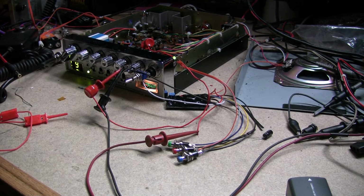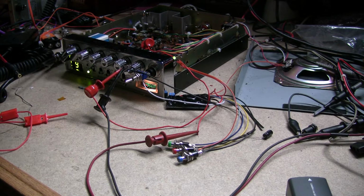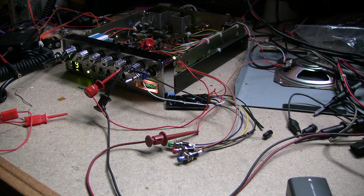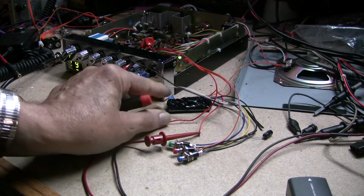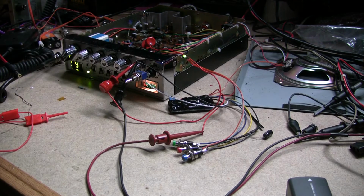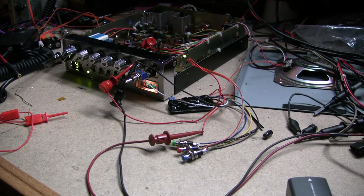So this has how many wire hookups? It's got one wire that goes right to the speaker, the positive side of the speaker, or you can put it to the extension speaker jack. Just find the positive side of the audio. It's got one wire output that goes right to pin 2, which is the standard audio for the 4-pin jacks, and it's got an output pot right here, this blue pot. You can adjust that for the output level, so once you get that set, you should be all okay to inject the audio into the pin there. And it's got a ground wire.